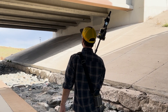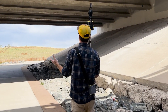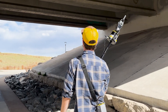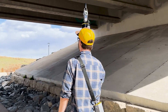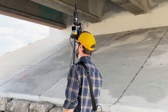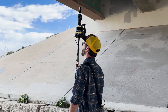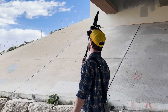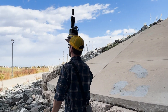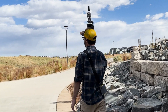The painting motion sends those scans out to the opposite side of the underpass, capturing the underside. In this particular underpass there's a significant amount of features. I'm walking slowly and at each of these little areas I'm doing that painting method. I don't want too much of an angle on it because that could cause issues with the IMU.